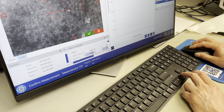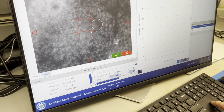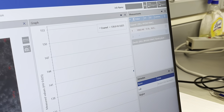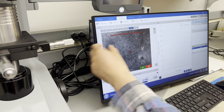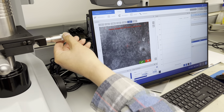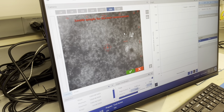Make left-right adjustments and click on that. You can click and get the hardness reading right over here. This will be the next indent. Remember, this is a manual stage, so you need to move to the next one. Make sure the spacing between one indent and the other should be 2.5 times the indent distance, otherwise there will be interference. Find a location somewhere here — first find something relatively flat — and look at the sample for the next indent.